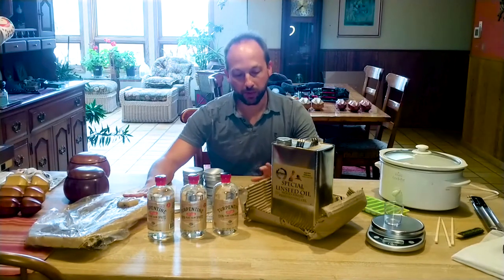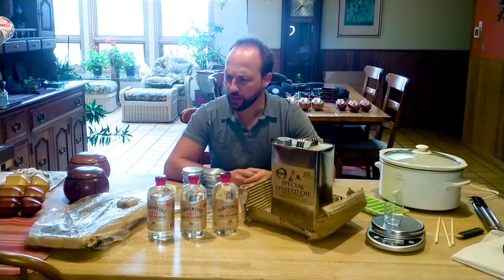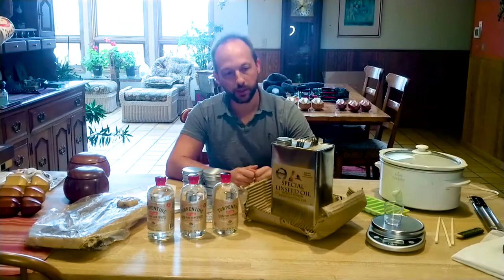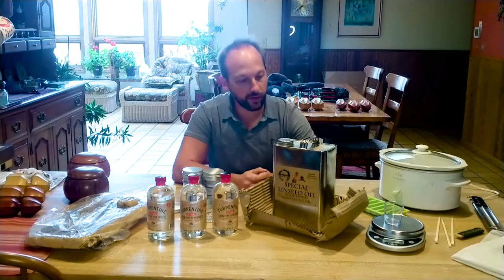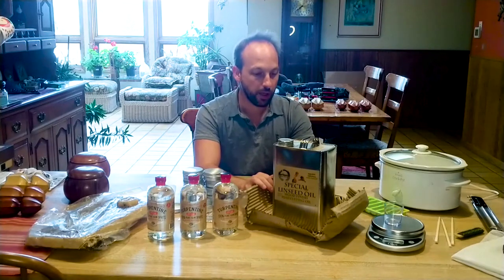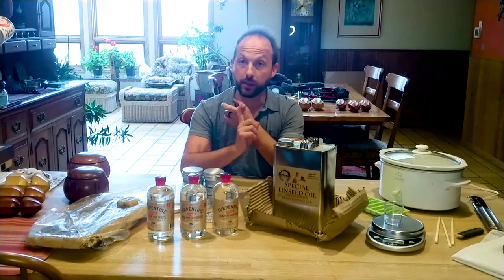The thing I like about beeswax and linseed is it's going to have a nice, soft feel. Raw linseed, I've heard, gives something a much more buttery feel than boiled linseed. And so coming over here to the linseed, what I've got here is a polymerized linseed oil, or a special linseed oil. I would say there's three types of linseed oil. There's raw linseed, which is just flax.